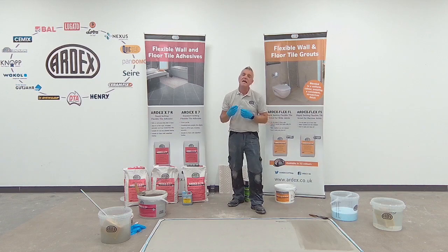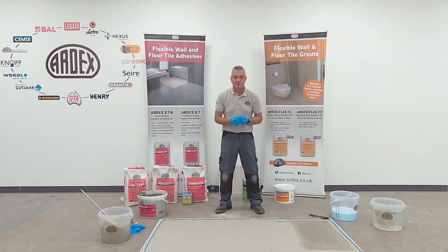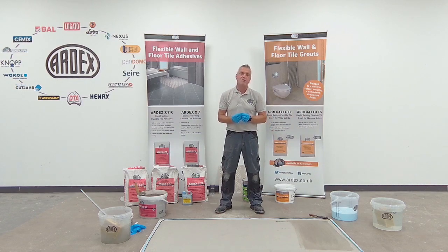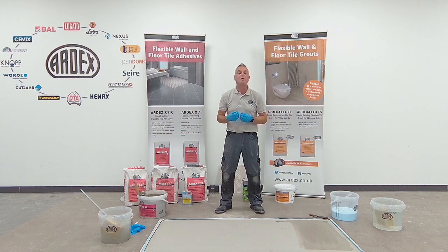But keep in mind, if you're fixing natural stones, you will still need to move back to our natural stone range, which is the S27, S28, S20, or the X32. These products have been formulated for water sensitive stones, that type of thing, but they are rapid setting. So be mindful not to mix large quantities.